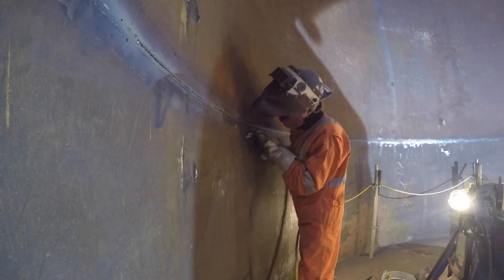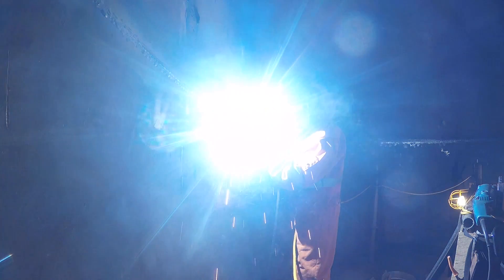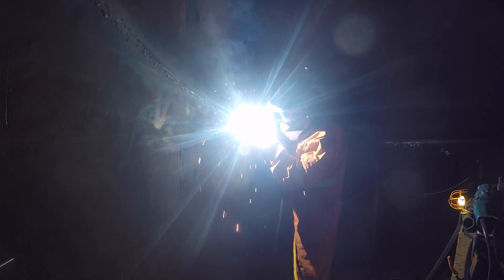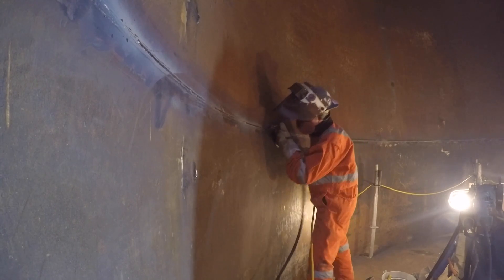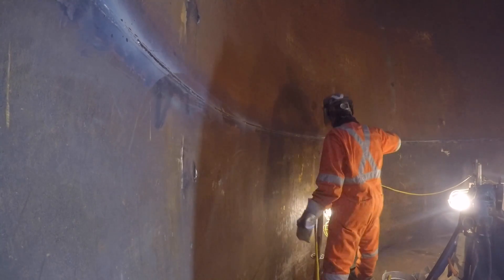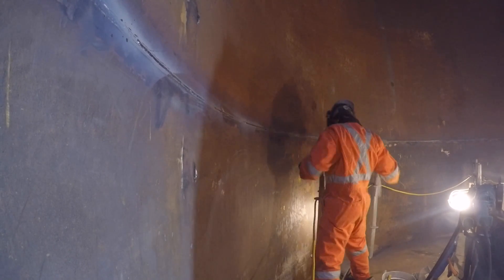If you haven't noticed, I'm not pushing any of this — I'm dragging the puddle on every clip. For stuff like this I don't push my flux core: you can't really rest the nozzle against the shell to push, it's much more difficult to keep your beads straight, and dragging is so much faster and lays in so much nicer. On long runs like this, one guy was doing 17 feet in one go — overheating the whole nozzle — and dragging just makes it that much better. You put your nozzle against the shell, hold a small angle, and it works out pretty good.